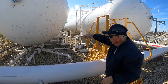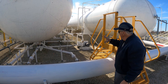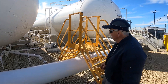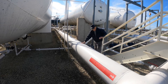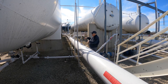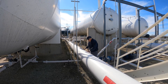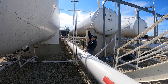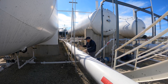Here are my vapor lines coming off the top of my tanks and dropping down. At other places they'll keep vapor lines really high and make only one or two drops, but when we built all of this we had no crane available, so all the pipe — three inch, two inch — we brought up with ropes and manual labor, then secured it all. They all drop down into that six-inch pipe that runs over toward my compressor, tying this end of my tanks vapor-wise over there.